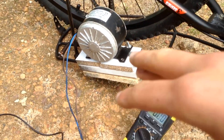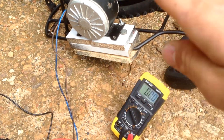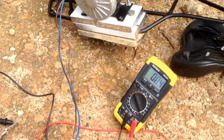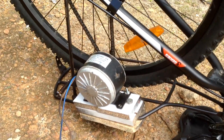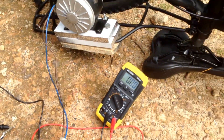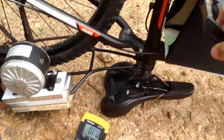With the step-up converter, it allows me to charge at a high rate of current if I'm going fast, but if I'm going slow I can still charge at a lower rate of current. There's no way I could make 36 volts directly — I'd have to go like 100 kilometers per hour to do that. That's why I'm using the step-up converter. I'll show you a bit more how much voltage it can make without any step-up transformers.